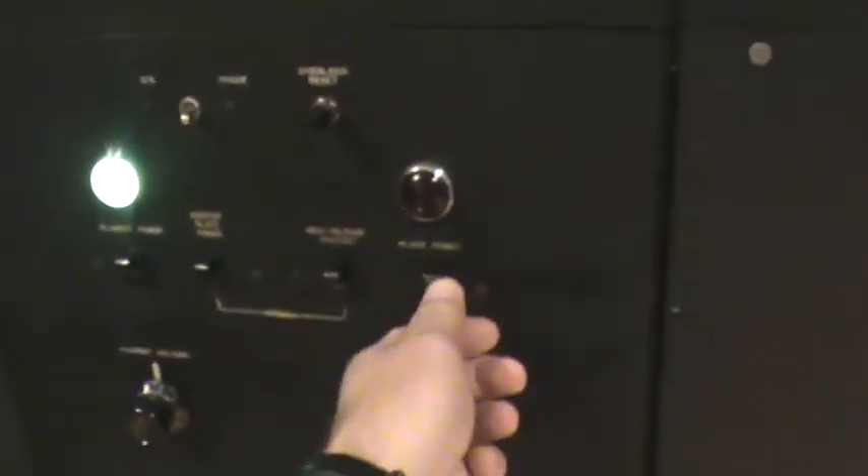We're on the protect side so that won't damage anything. When any door is open, the primary relay will not operate, so you can't get plate voltage — that's a good safety feature so you don't get a shock by putting your hands in there. So let's try it again. There we go, and we'll dip the plate.